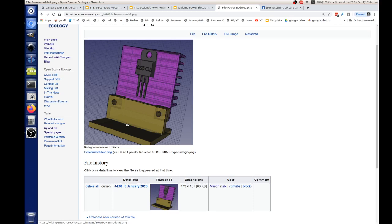Now, if you have these brushless motors, they're a little more complex. You need a controller that's a little different. But for brushed DC, it's very easy to control motors, and there's a lot of DC motors out there for practical applications. But brushed DC is not as long life as the brushless, so we like to transition to the brushless for lifetime design, as opposed to the brushed. We pay attention most to lifetime.